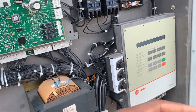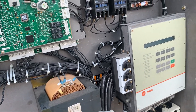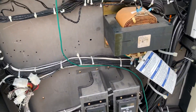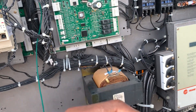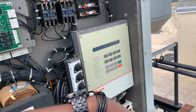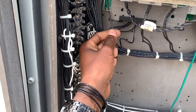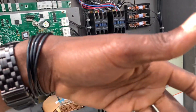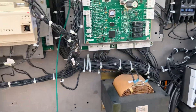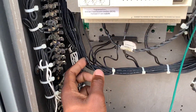So the temperature reading will go up as well. As the resistance of the sensor increases, the amperage draw decreases and the temperature will go down — so I think that's negative temperature coefficient. Because if I disconnect one of the wires, the amperage draw is basically zero and the temperature starts to go down. Come into the comment section if it's positive or negative temperature coefficient — it doesn't really matter here.